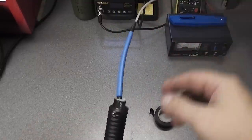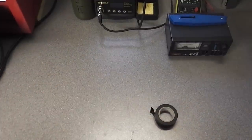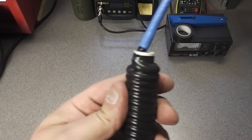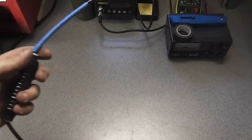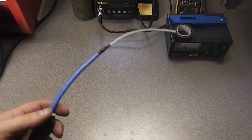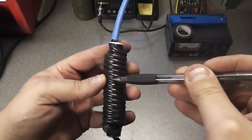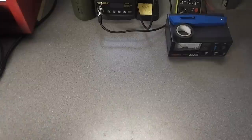That's pretty much the antenna made. I'm just going to wrap the balun properly off camera. Once done, your antenna is essentially complete. All that's left is to put the connector on the other end and then go out and SWR it in a nice open area away from trees, buildings, and cars — you'll get a much more accurate reading that way. The balun has one, two, three... all the way to fifteen turns.